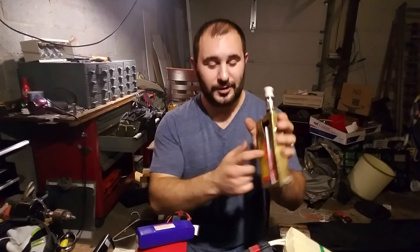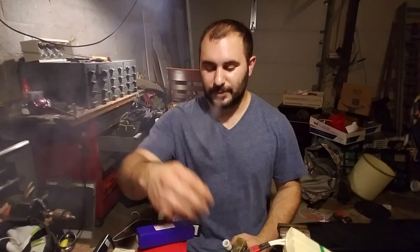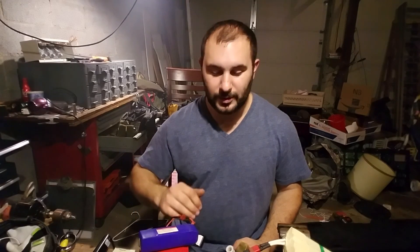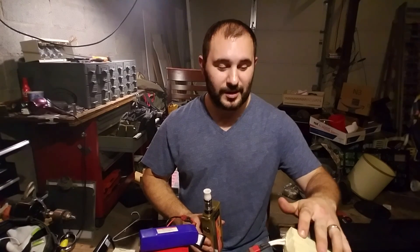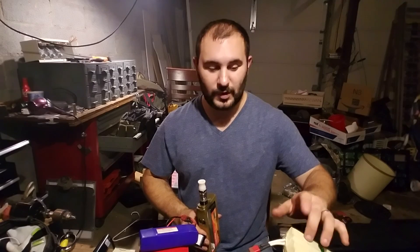A DNA 200 wouldn't even work because they require a 3S. I need a 200-watt chip that I can use with a 2S battery — let me know what you've got, because I have my Tesla 200 but it's not high enough quality for me to consider using it. We're up to constant voltage — this is only a 2650 mAh battery so we're already at constant voltage. It was about half dead, and as the primary load is now off, it's actually increased to almost 7 volts, bouncing between 7.0 and 7.1 from 6.7. There's a fairly decent amount of voltage drop even boosting up to 12 volts at 3 amps, so I'm probably pulling close to 6 amps off of this.